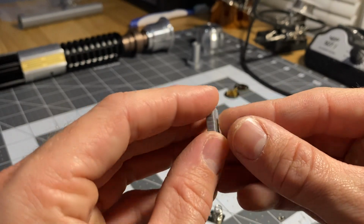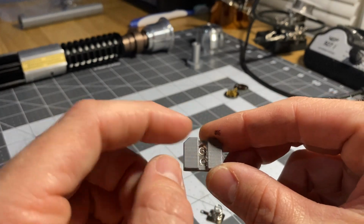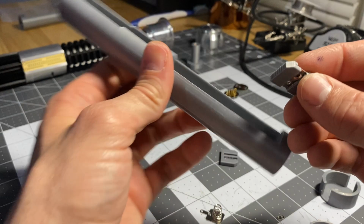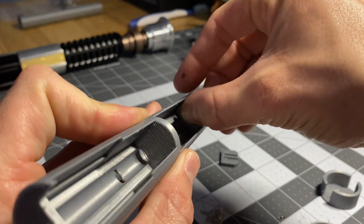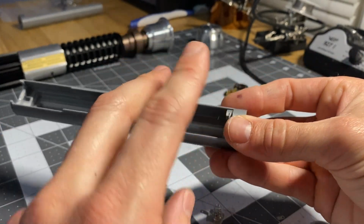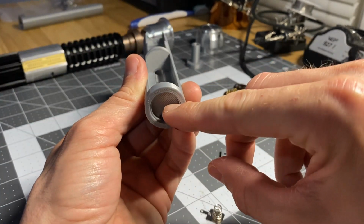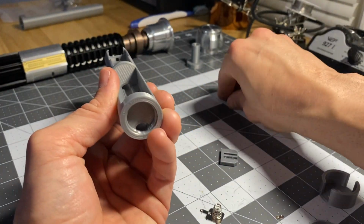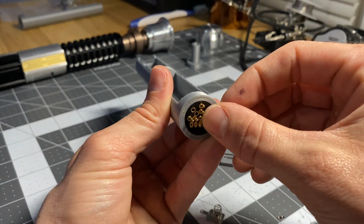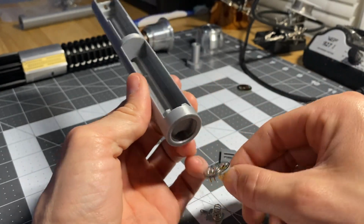Now my suggestion is that you do 2 positive wires, twist them together and solder there. You'll have one long one that's going to go all the way up at the top, to your board, and then the other one just flips right through that little bottom hole there and is soldered to this 7-pin connector, so it gives your NeoPixel power. Pretty smart, huh?